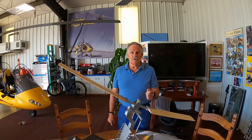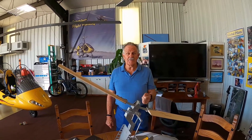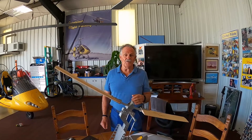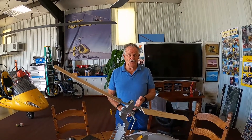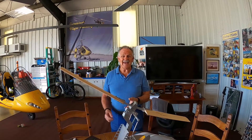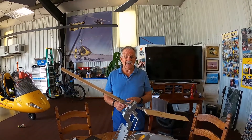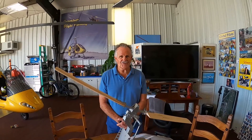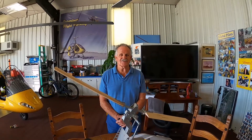Now we'll go watch a real live video of an actual gyroplane crash — a rotor blade flapping. In this case, from my experience, they moved the cyclic too far forward, got too much ground speed as you will notice in the video, not enough rotor speed, and then they actually yanked the cyclic back and caused the crash. I want to warn you that this is a real gyroplane crash on takeoff. Your discretion is advised.